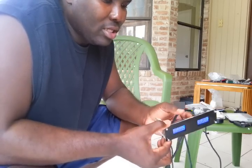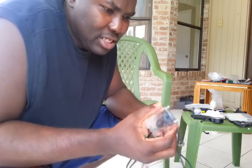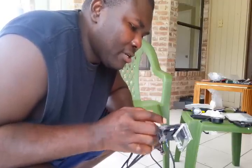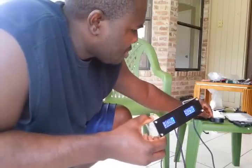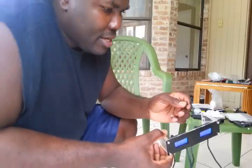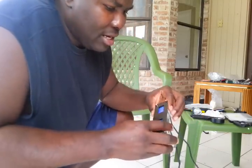When I mounted the temperature sensors in the frame, there was clearance between the sensor and the face plate — the face plate should hold the sensor snug. Because of that clearance, when you shake it you hear a clicky sound. So I got some electrical tape, folded it several times, and placed it between the sensor and the face plate to hold it snug. Now when I shake it, you don't hear that clicky sound anymore.